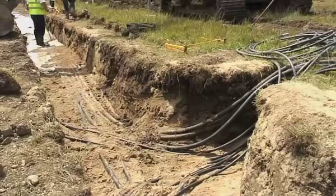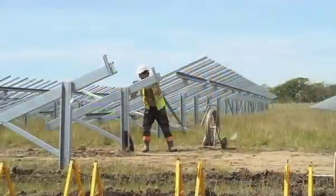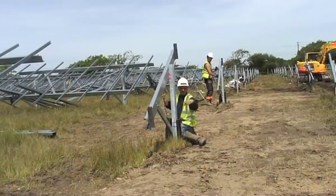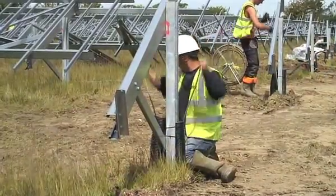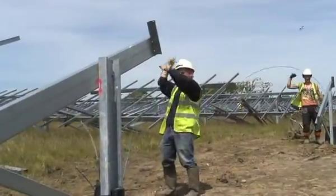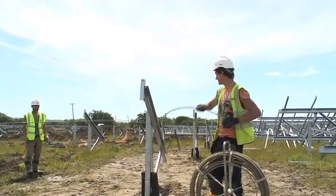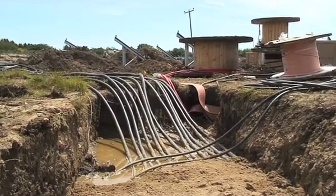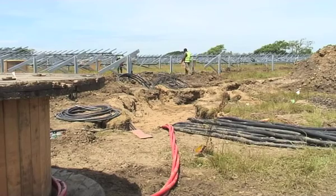They use sand rather than just putting back the topsoil because there are no stones, and it does two things. Basically it's stopping any heat spots and it allows the heat to dissipate — because you have lots of power going through those lines, you want to make sure the heat is dissipated. It also removes any chance of sharp flints and stones abrading the insulation and causing an earthing fault on the cable.